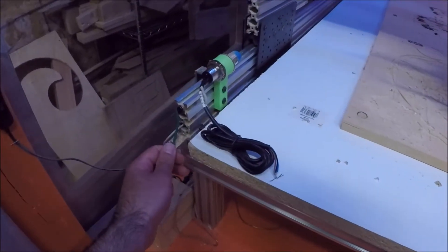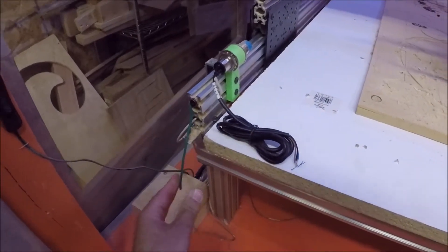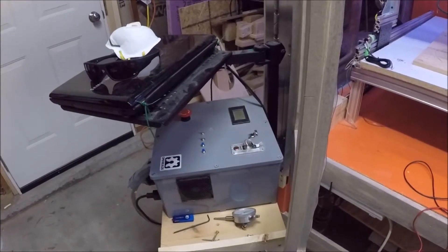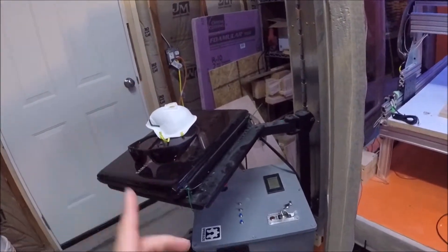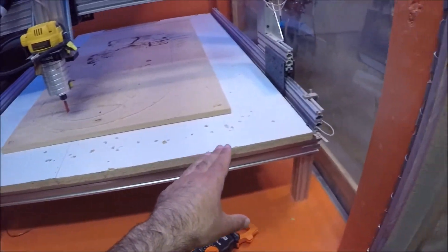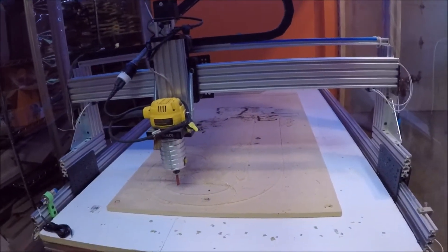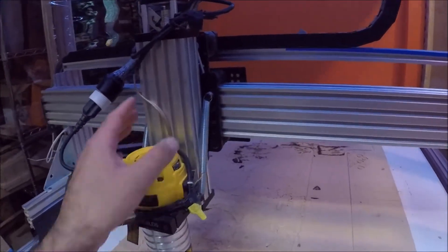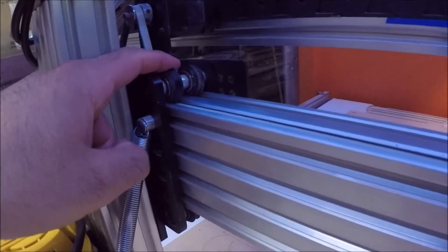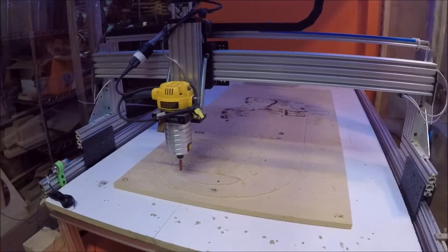Let me show you what I've done. On three places of the CNC, I've routed conductors and bolted them to the aluminum extrusion. These conductors are then routed back to my control panel, all terminated at a single point, and that point is bonded to the house ground. I've got one connection for the bottom of the CNC, another for the gantry, and another for the Z axis. The reason I did three is because every movable part rides on V-wheels, which are hard plastic, so there's no electrical continuity between sections — I just had to route three conductors to make sure everything's bonded.